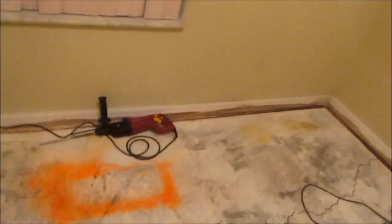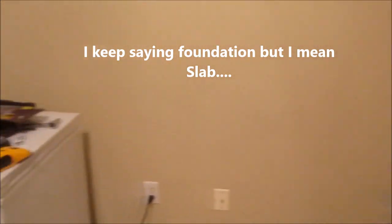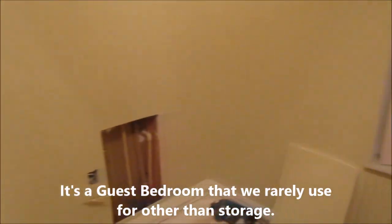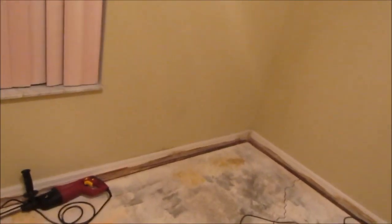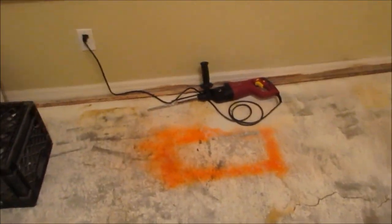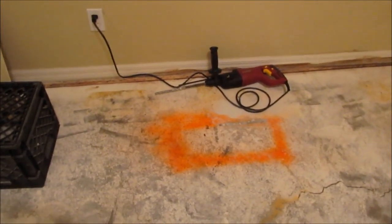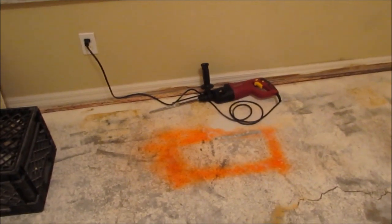Here's another symptom I didn't understand at the time but now all the pieces come together. We have a freezer in here, and every time I opened this door to the room it would be hot. I'd always dismiss it and say well that's the freezer. But it wasn't the freezer — it was the hot water heating the slab in this room. Through troubleshooting, the water company guy came by and said hey, you've got a leak. I'm going to have about a $300 water bill this month.